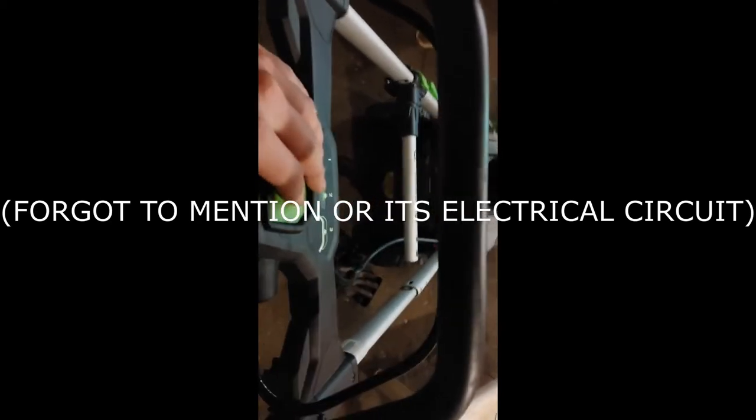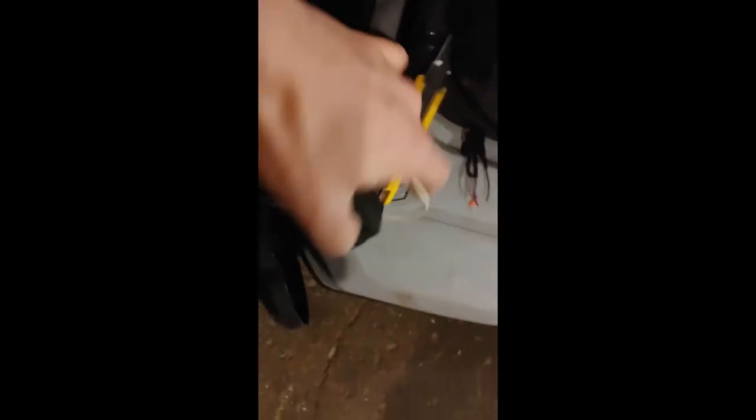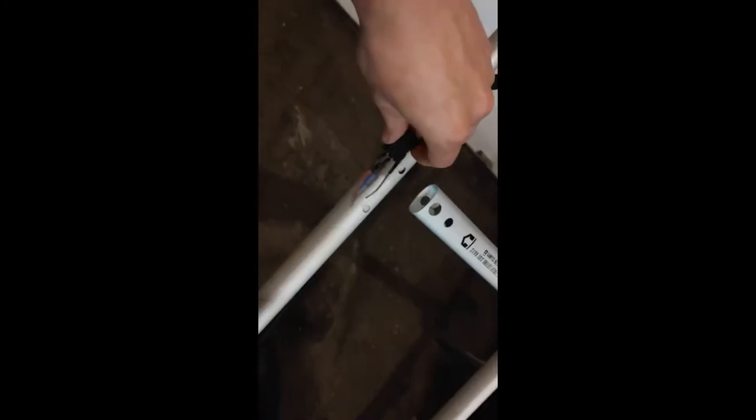It's an easy, simple circuit. The problem is most likely to come from the security safety switch. You get one safety switch here, another one there that I dismantled, and another one here. I bypassed this safety switch for testing. All the switches tested good.